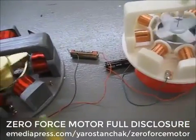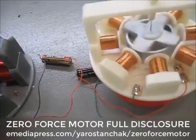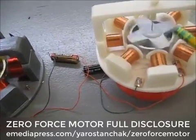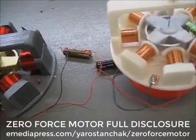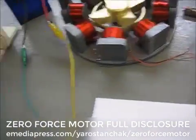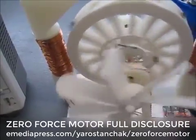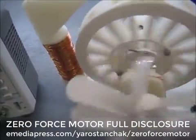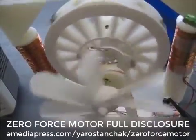One is pushing and one is pulling, but there is no push-pull arrangement in this motor. You can tell if you just did the experiments that if you try to push-pull this motor, these coils would have to be arranged much differently. These coils are arranged vertical and there is no horizontal coil. So you're riding the flux lines that the magnetic field generates.